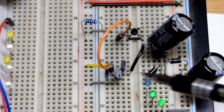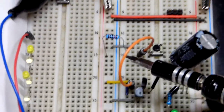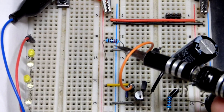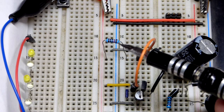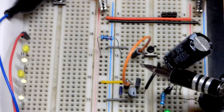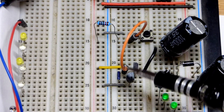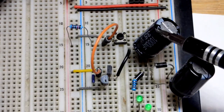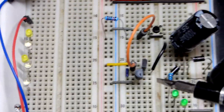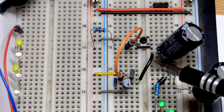Something has to give us the changing voltage to our transistors. What I've got set up just for demonstration purposes: we have a pull-up resistor. It keeps a high voltage — 5 volts in this case — to both transistors, which keeps the N-channel transistor on. So most of the time you'll have that capacitor charging. With the push-button switch, I'd have to hold it down to give the opposite.